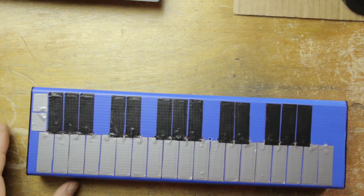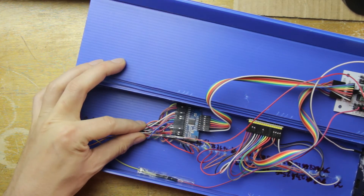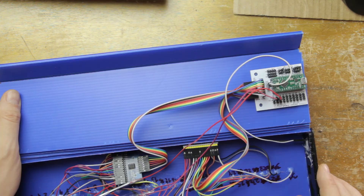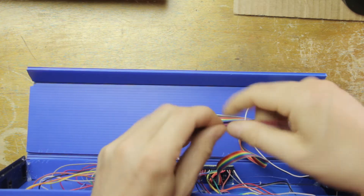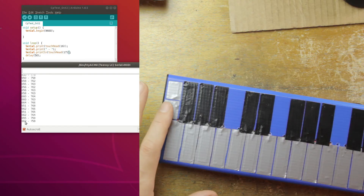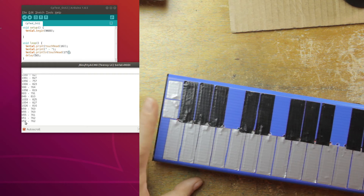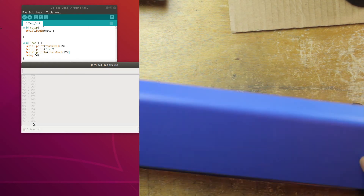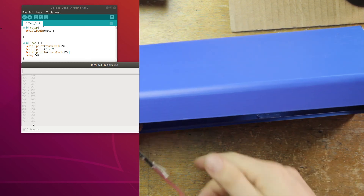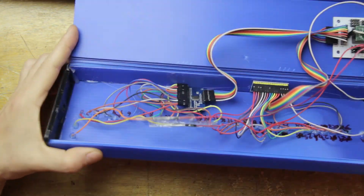A lot of the battle in the click instruments can be won at the other end — not by maximizing sensor readings but by minimizing parasitic capacitance — and one of the best ways is simple cable management. All of these cables are sensing capacitance, so they're actually able to sense each other. If you get them tangled or scrunched up together too much, you'll get crosstalk where activating one sensor is also measured on another. Let me demonstrate: I'll unplug two cables, roll them up together, plug them back in and read just these two. Both register fine individually, but the one I'm not touching also has a significant reading. The click code and calibration takes this into account and will work even with less than perfect cable management — this mess right here, for example, is perfectly functional.